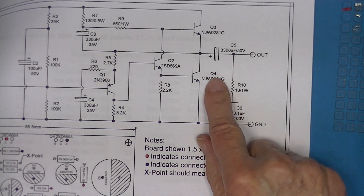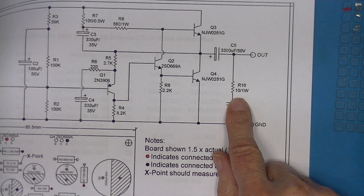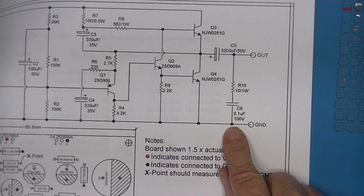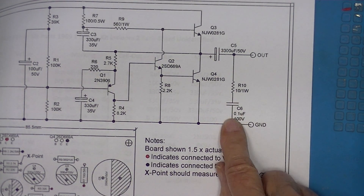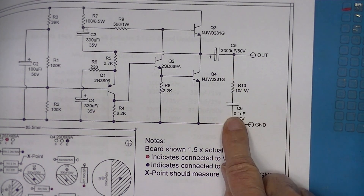This is going to cause the high-frequency output to roll off greatly. If this is a 10-ohm resistor and we only have an 8-ohm load, this designer is anticipating dropping a quarter to a half a watt at whatever frequency this is active. That'll be interesting to look at.